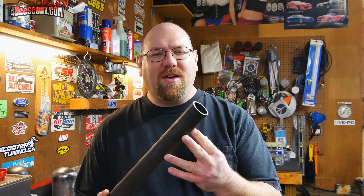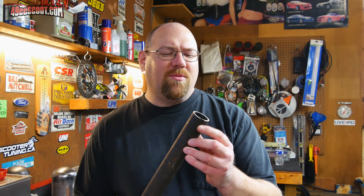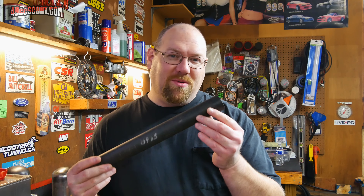I'm going to move on to doing the filler neck. I've got some inch-and-a-half black iron pipe here. I'm going to try to cut that down a little bit on the outside to smooth it out, then cut some threads on the inside. I've got a chunk of two-inch aluminum round bar coming, and I'm going to try to cut that as my filler cap. I'm also very bad at threading — I've tried it one time before and it didn't go perfectly, but I decided to punish myself and give threading another try.